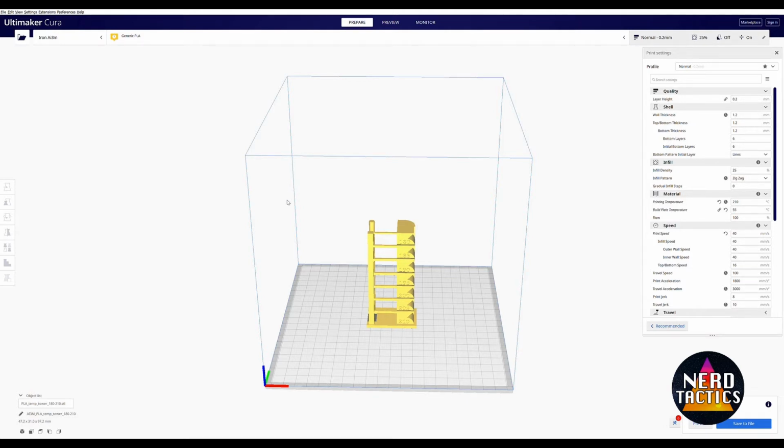So what we're going to do in here is we're going to come in here, and the first change is at 16.46. We're going to change the extruder temperature from 210, which is where it was, to 205, because that's how it's marked on the temp tower. Okay, and we are going to repeat that with each subsequent layer. So the next one is 29.92. We're going to change it to 200.